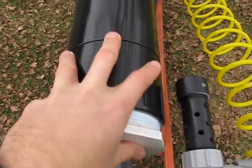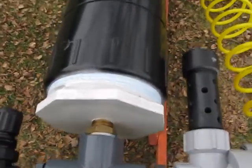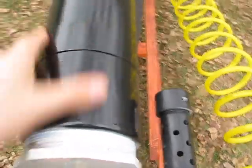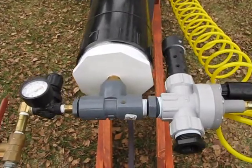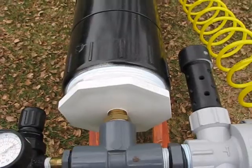What actuates the big piston valve in here is losing air behind the valve. It causes a differential in pressure behind the piston compared to what is in front of the piston, causing it to fly back and open up the barrel. So what I'm going to do now is dismantle the back of this and show you how I ended up constructing the piston.